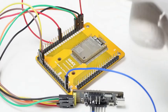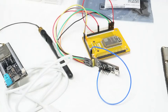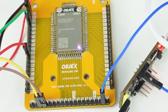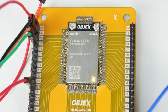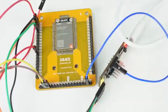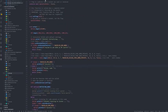It takes about 20 minutes per module, so I need to automate this process. In the next videos I'll show progress on testing — it's complex with many tests involved. We need to check the GPIOs, verify soldering quality, check the entire radio section, verify the power part including all individual LDOs, the power latch, and the RTC. We want to test everything to ensure the highest possible quality standard.